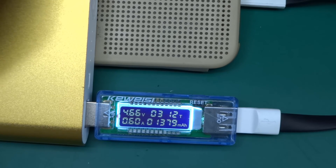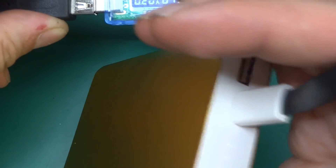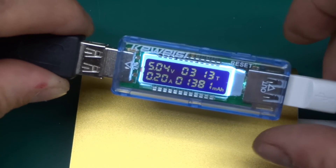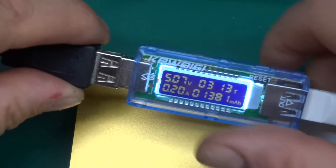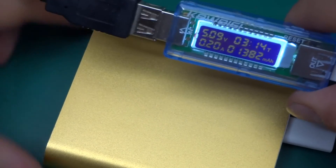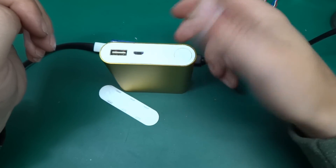Here it is charging: one of the LEDs is blinking, and since it's the last one, you can tell it's almost full. It's putting in about 200mA total, so each battery gets roughly 50mA — a really low current that will drop even further. In the final stage it might drop to 20-30mA, which takes a really long time, but as I said it's easy on the batteries.